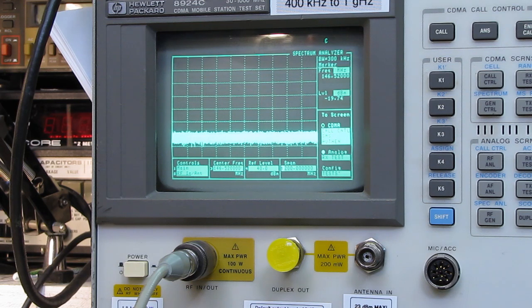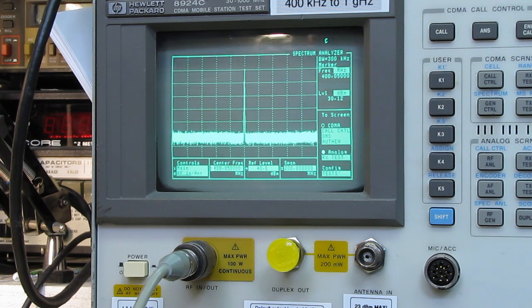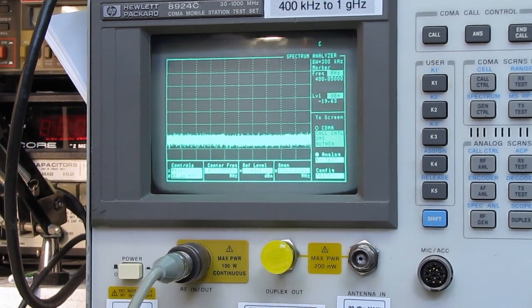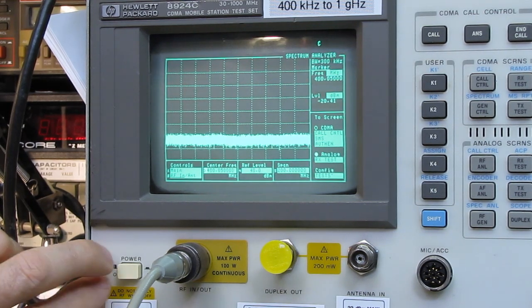Let's test it on the 400 megahertz frequency. That's 400.050. On key up, we got a couple of spikes, but that's just the oscillator locking. And I'm not even seeing them now on successive key ups. When your PLL first locks, sometimes you get some erroneous signals, but now that it's transmitted once, it's perfectly clean, absolutely acceptable. Beautiful signal, nice and clean. Very pleased. Getting excited about this radio, even though you know how I feel about the imports. It works well. Okay, now I'll go over and we'll try our minimum discernible signal.